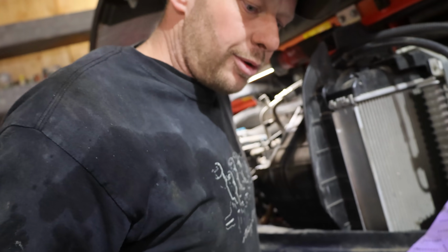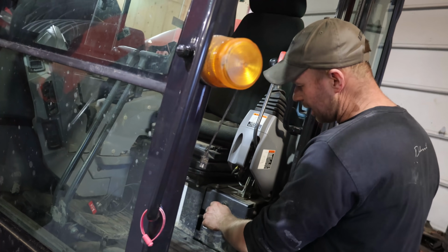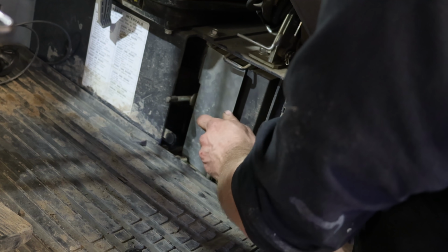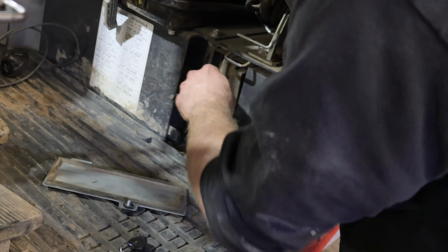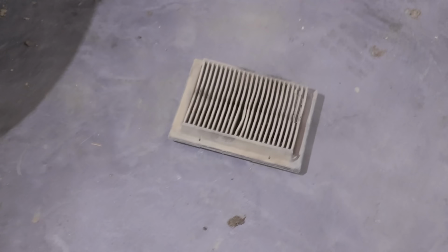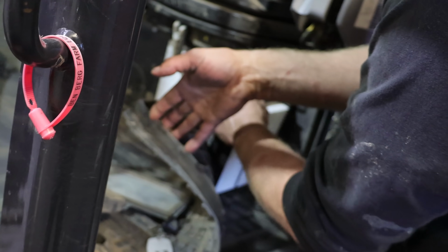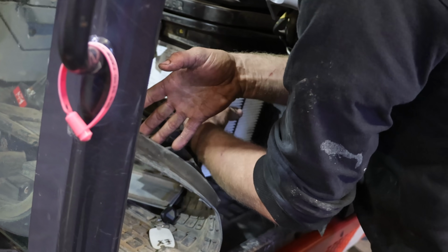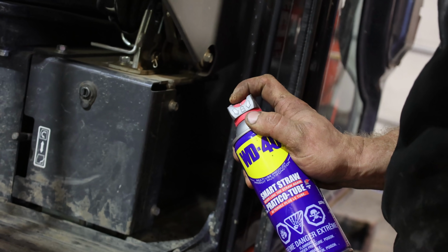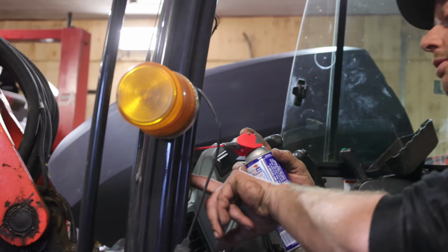A full system compared to a semi. And now we can put our fuel filter back on. All right, so the cabin air filter is underneath here. Little trap door. Now you can blow that out, or you can replace it. Probably a good idea. Stay up on it, blow it clean whenever you can, and then once a year, it's always a good idea to just lubricate your hinges a little bit. And then your rollers for your track.